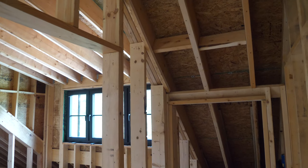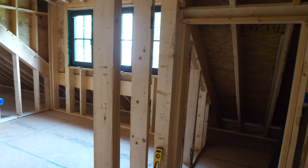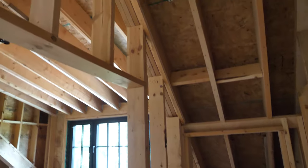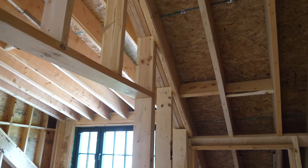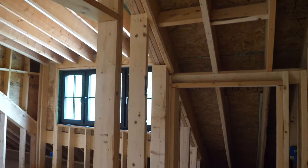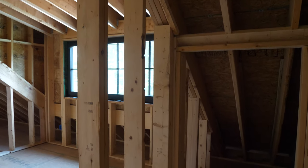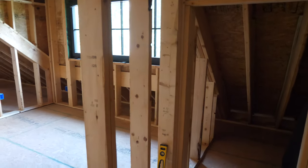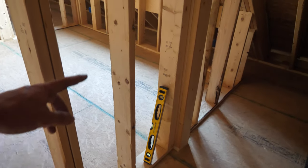The next little framing task is in our bedroom closet — this is to increase our storage space a little bit. It's certainly not the biggest closet in the world, and I didn't realize in my plans that I had spec'd this closet wall as a two-by-six wall. I think it was because it was underneath this big beam right here. But regardless, it's a closet wall — it doesn't need to be two-by-six and it's not load bearing. So instead of just leaving this hollow or filled with insulation when we put the drywall up, I'm going to make some niches out of this little stud bay space.